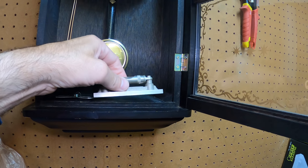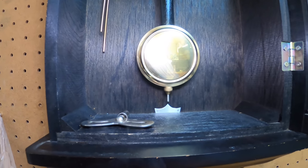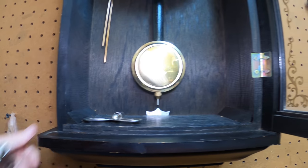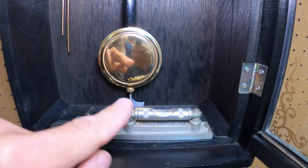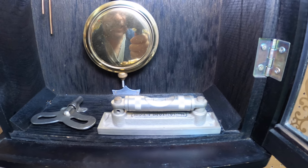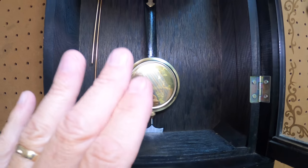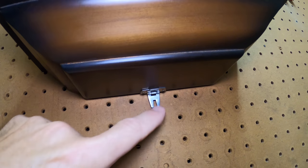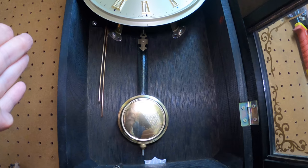I also take a level — this is something else you can do — and make sure the clock is level. These are mechanical clocks, so it has to be right or it won't run. I use a level to match the pivot point in the center. You can see it's just off a little — you want to get it exactly right in the center. Even a small offset matters. There's a pin on the bottom so you can secure it to the wall so it won't shift left or right. Once it's centered and done, it is perfect. Then you just start the clock up with a simple tap.